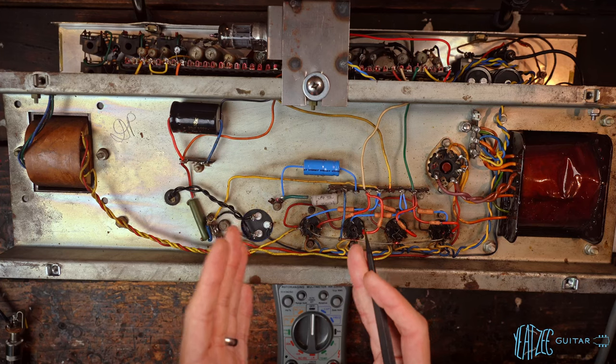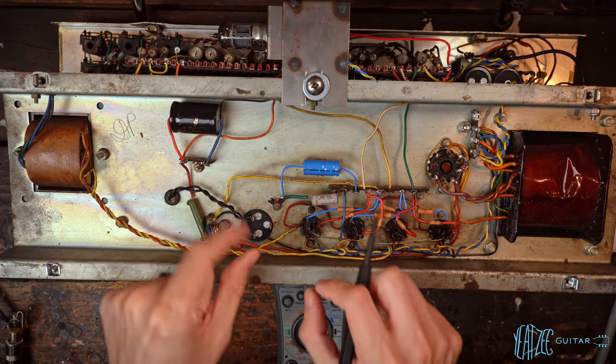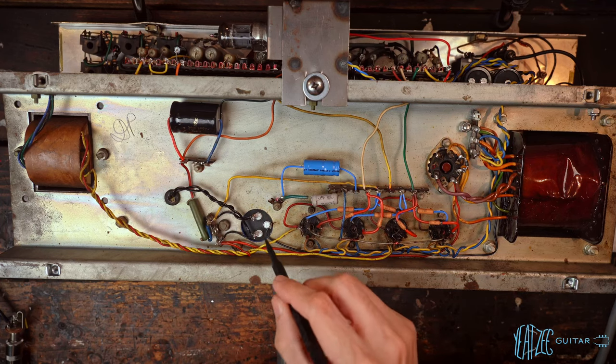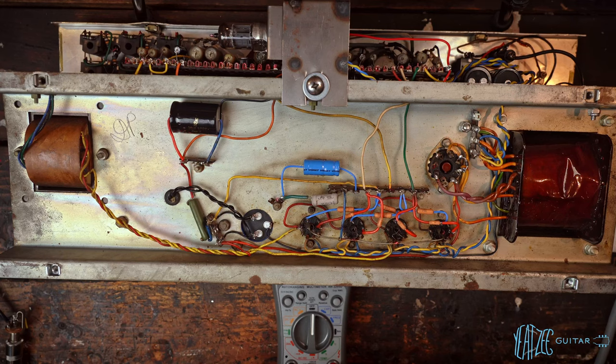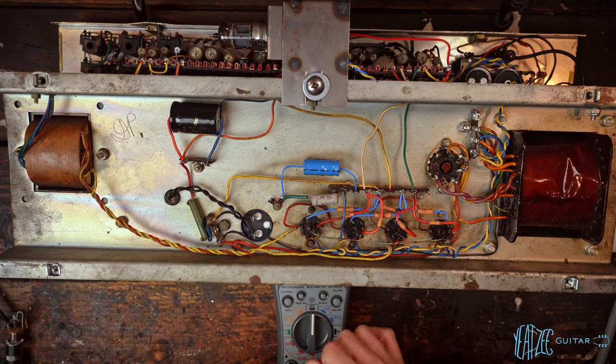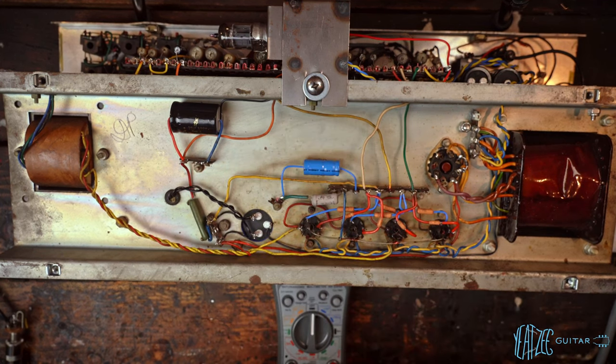I came from knowing nothing and here I am, but I took my time, watched a ton of videos, and was very careful. I want to encourage anybody inspired by my videos to try this on their own — please do the research and make sure you have some idea of how to do it safely. The biggest thing I've shown in multiple videos: discharging the caps, making sure there's no voltage sitting in the amplifier waiting to shock you. This method is done with the amp live, which makes it very dangerous because you'll have 300-plus volts coursing through many of these nodes.